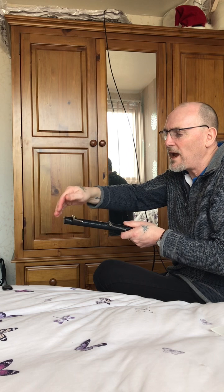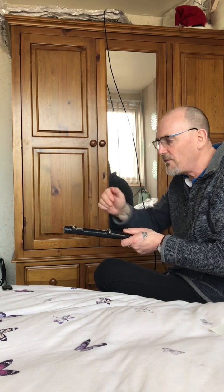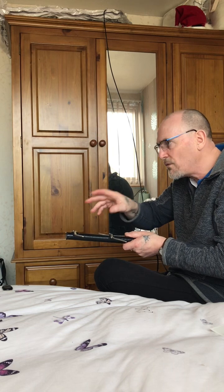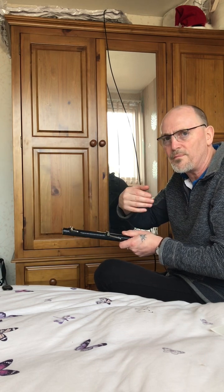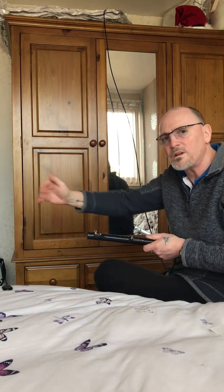You can actually pick out people who, there may be 5 stations all within a geographical area close together calling you. And if your antenna's got enough elements, you can single each one of them out. Whereas this one, its beam is still wide. It would transmit into that area, but it would be transmitting to all 5 stations at once and receiving from them. So although most of my energy will go that way, it's still not narrow enough to pick each station out. So we would put more elements in front, called directors. Think of it as directing your beam.